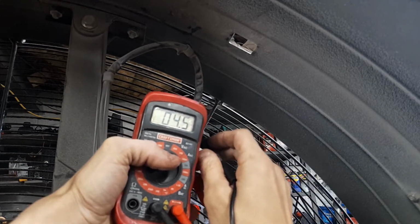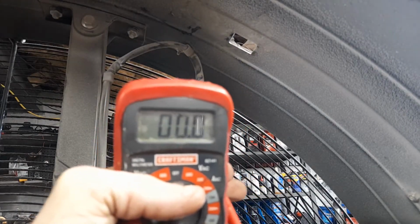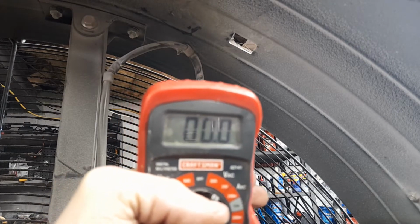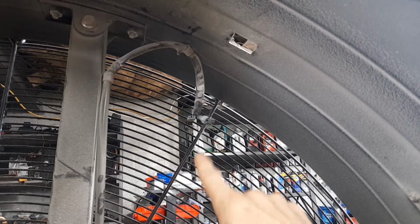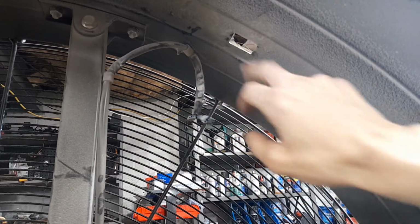4.6 alternating current volts. And yeah, I did a couple other ways, but there was no way to get to the 110 or 115 volts which I was expecting to see. However, knowing the bit that I do know about electricity, there is a chance that we're only supposed to receive 4.5 volts here, as 110 volts might blow that switch out.